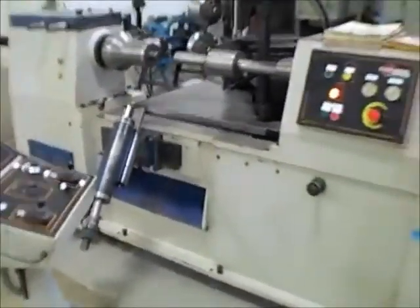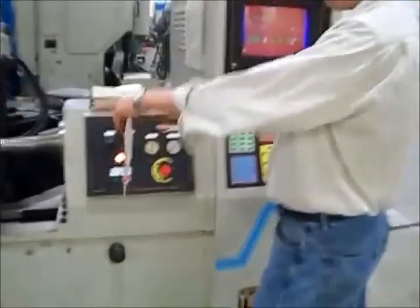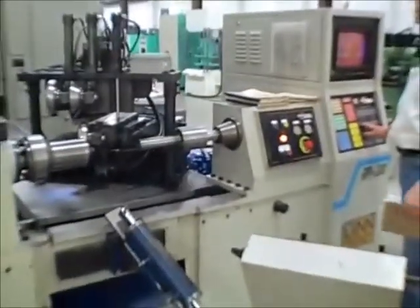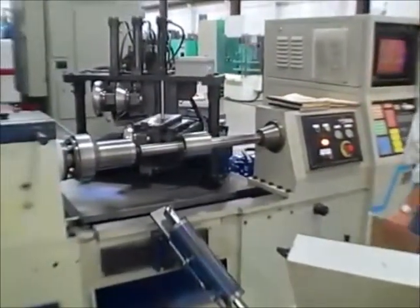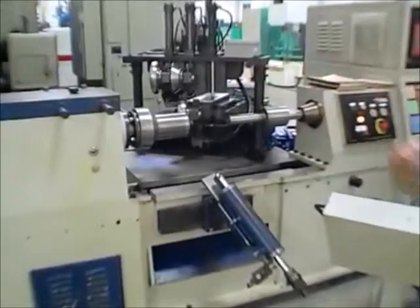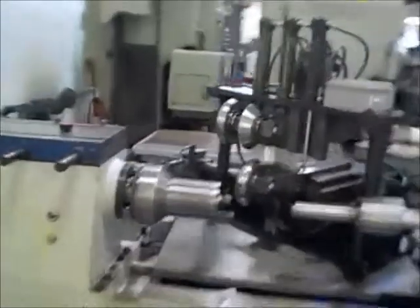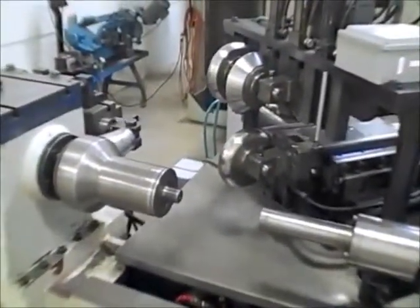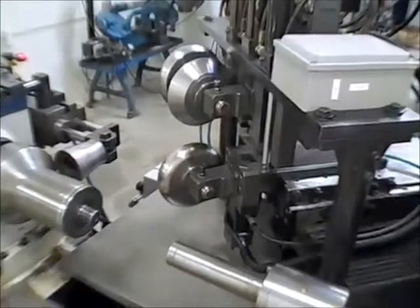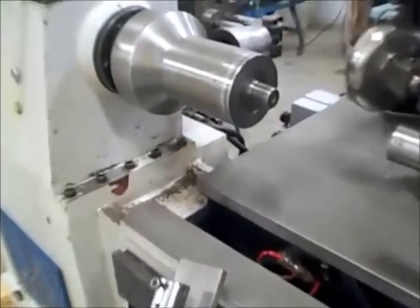As long as we're in manual mode, I'm going to start off with a few hydraulic functions. Tailstock would be number one — I'm going to run this in and out a few times. This all happens automatically when I'm running the program. You've got the support on here next — I don't know if you can see it back here. This is the support that comes out. I'll do it a couple times. Now the last one you can only hear, which is the knockout — it's inside there. See it moving? That's the knockout — that's that cylinder in the rear.